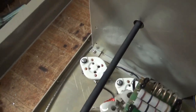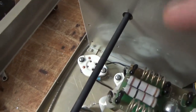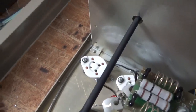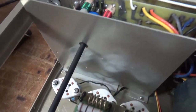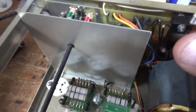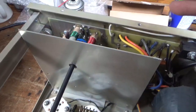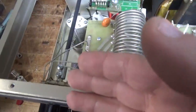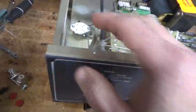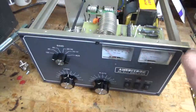All three tubes have their filaments in parallel, so you only need one gas discharge tube per side of the parallel filaments. I compressed the socket clips and removed the metal oxide varistors. I cleaned the input rotary switch with DeoxIT Gold and cleaned the band switch and output rotary switch with DeoxIT Gold as well. You can see the new meter protection diode and the new SO239 — this thing is all set. Tested full output on all bands.